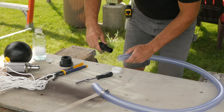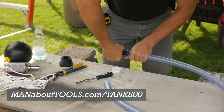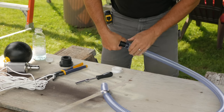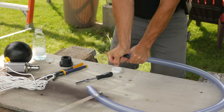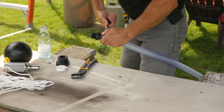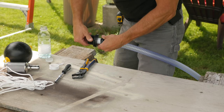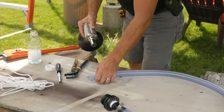I bought some of the tank parts and decided to make some of them from existing fittings. I'll have links to these parts in the description or in my blog post at manabouttools.com/tank500. I cut the float hose down to a length appropriate for the height of this tank — around two feet. There's a barbed fitting that goes into the inside part of the bulkhead fitting first, then the clear flexible hose goes on to that. It was a tight fit, tough to get on even with soapy water as lubricant. Then a stainless steel hose clamp secures it.